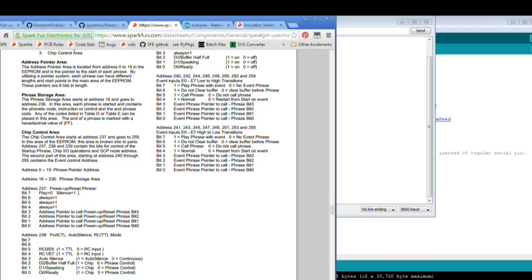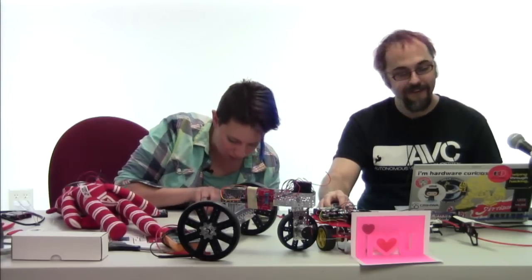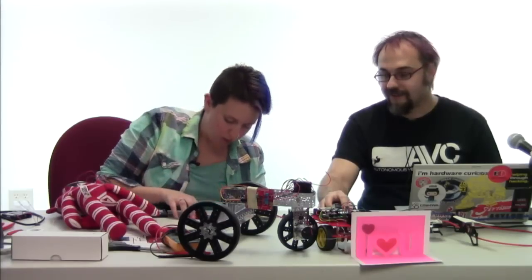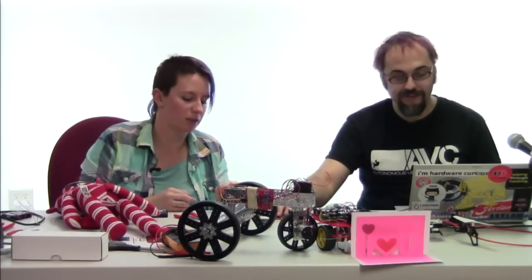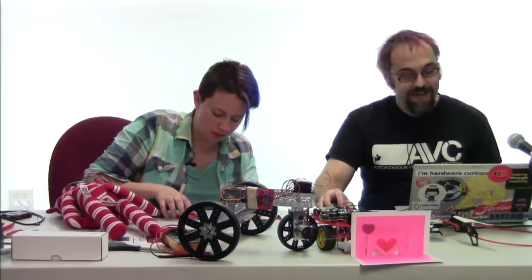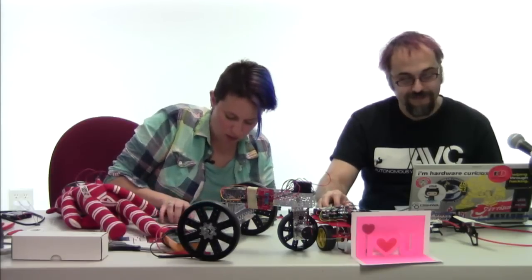And that... There we go. So yeah, the reason that we weren't hearing any of the volume is the volume dial was turned all the way down. And again, you can see pliers are not really a great way to go about this with this potentiometer. It's kind of eating it up a little bit. This works really well with a pair of, for example, eyeglass screwdrivers. You can change this a lot better with those. So get that turned.